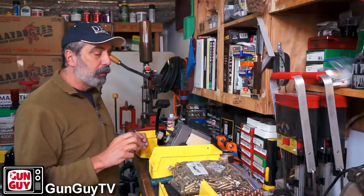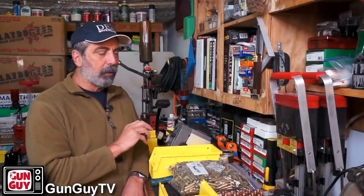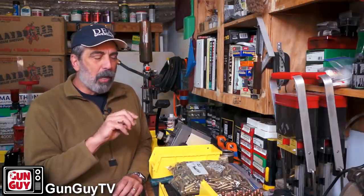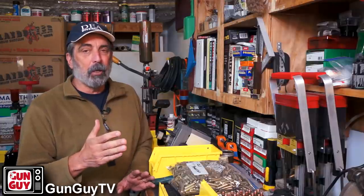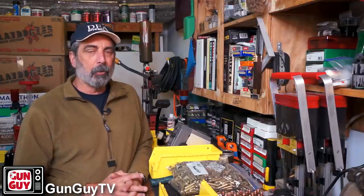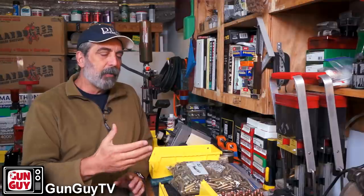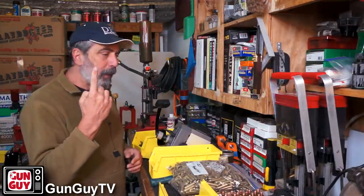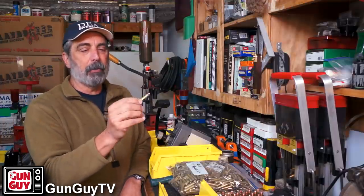There are some other interesting things too. I've always believed in the use of templates to save time. Every video I've watched on this thing shows people using their micrometer, doing all this different stuff to get it set up. I thought, why don't you just figure out one piece of brass and use it as a template? I grew up in the construction trades — when I'm on a table saw trying to cut 13 boards that are all five foot long, I cut the first one, mark them, and go. I just make a template. The same thing can be done with brass.